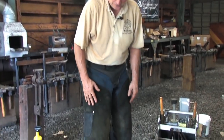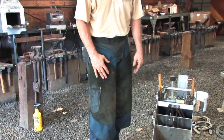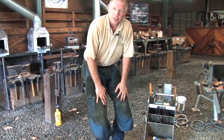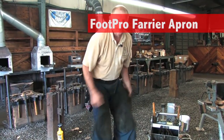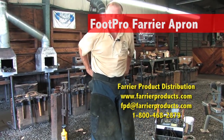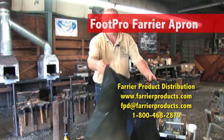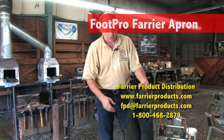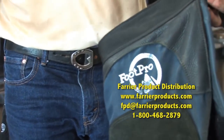When you're working on a horse's hooves — even cleaning them or picking them out on a daily basis — get an apron. Get an apron that fits you. An apron protects your legs from the hoof. The edges could be sharp, there might be some clenches sticking out. It also gives you friction so you can hold onto that hoof a little better. Get one that pulls away. This one has Velcro, so if the horse gets caught on me, it pulls away in every direction. It also has a secondary snap up here so that I can snap it off. It is Velcro that'll pull right away if I'm caught on the horse, and that's a very safe and effective tool to have when you're working on the horse's feet.